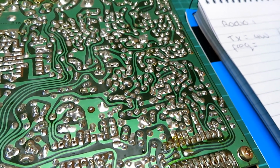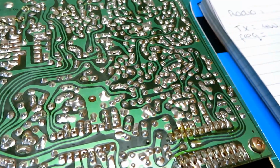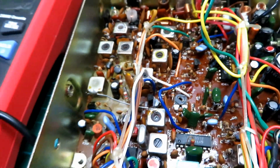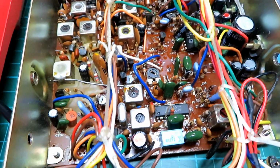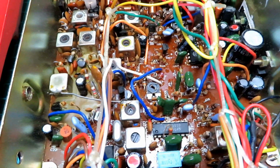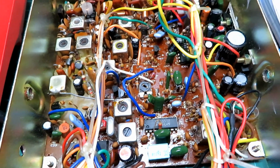Or they may have had some kind of pin that connected to this point here in the test rigs. We won't do that on camera, but we'll check the VCO as in spec. You can see looking at the radio that this hasn't been touched anyway, and that is definitely within spec. It's dropping to 2 volts on channel 1, and on transmit on channel 40 it's 3.2 volts.